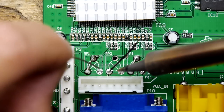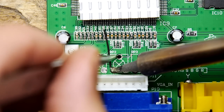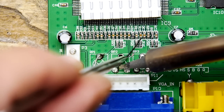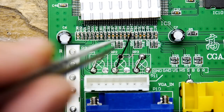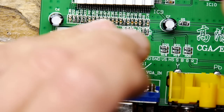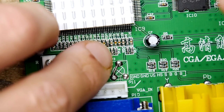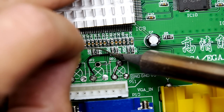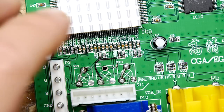This one requires something with a bit more finesse - that's some Kynar wire. We've got one end bonded there, pretty good, and then we're going to bend it over and attach it to the edge of that surface-mount resistor right there. Bang - job's done. See if the camera can focus on that a bit closer - yeah, that looks fine to me.